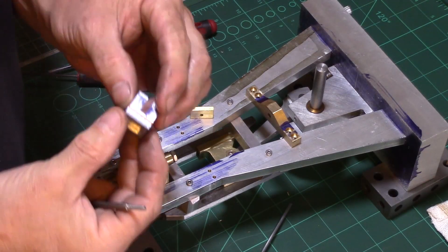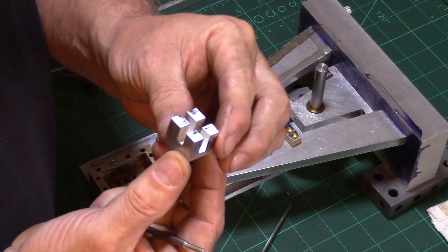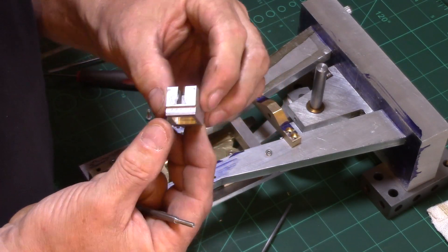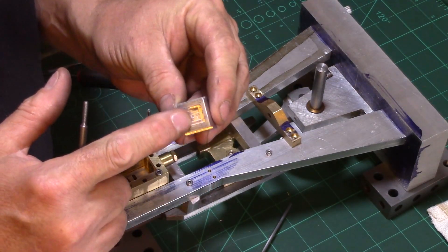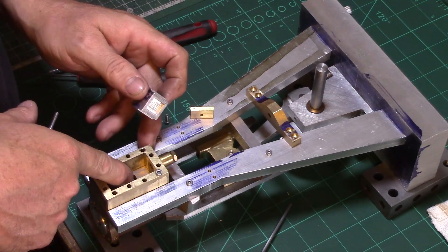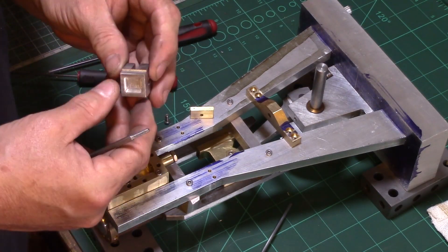This valve was made from aluminium and I had to remake the valve later as I'd made a mistake on the exhaust recess and made it too long, but I didn't realise this until the engine was run for the first time, so the next one I made was made from brass.